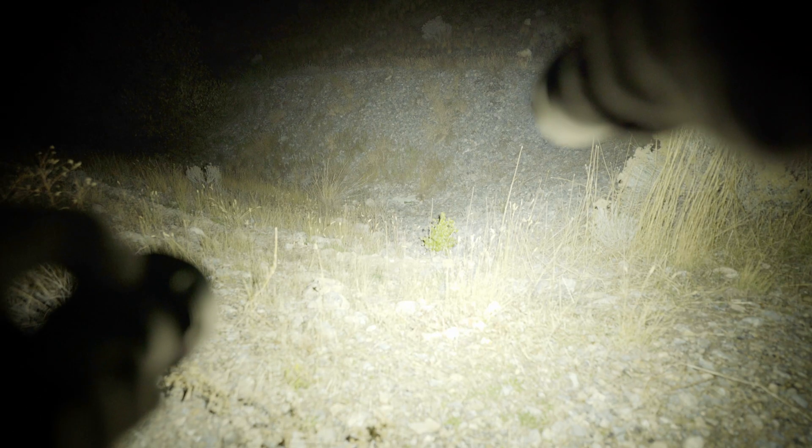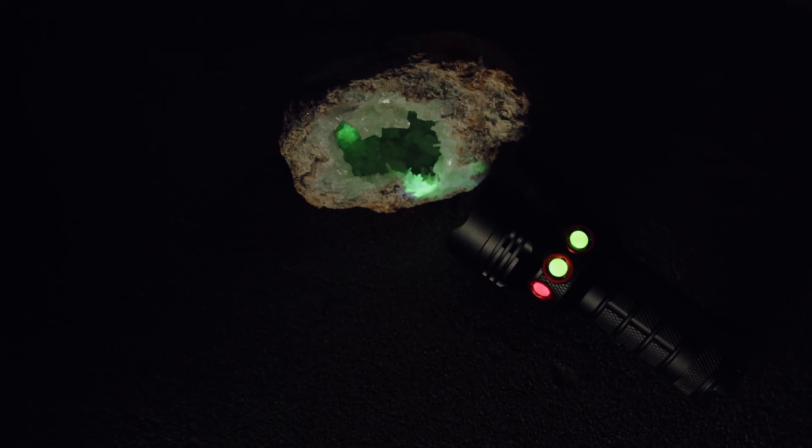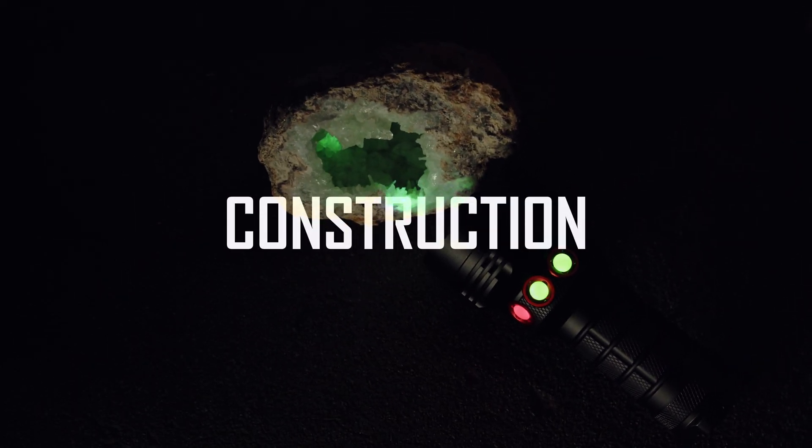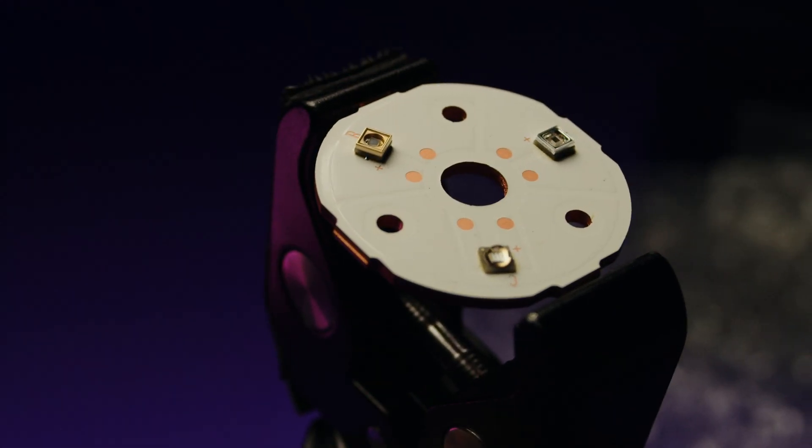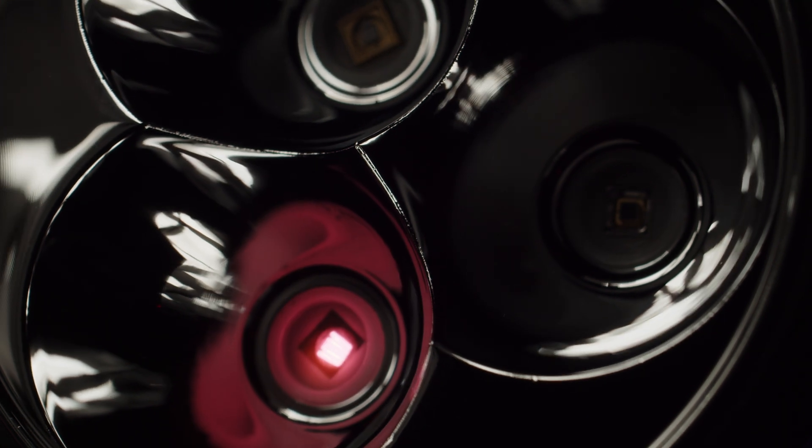This is a large amount of UV light, and when combined with the tightly focused reflectors, each channel is capable of exciting fluorescent materials at a pretty impressive distance. It's not the most powerful UV light I've used, but it's more than enough for honestly anything I could think to use it for — it's a very capable light. The emitters are situated on top of a thick copper MCPCB for better heat dissipation and sit under a large aluminum reflector.